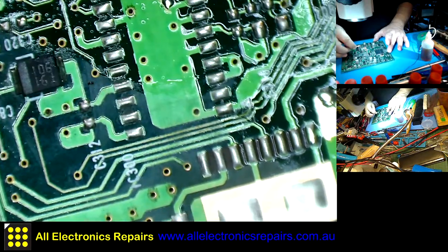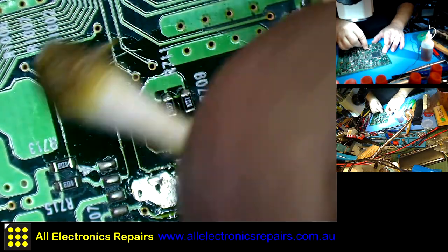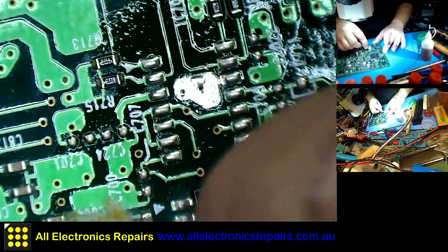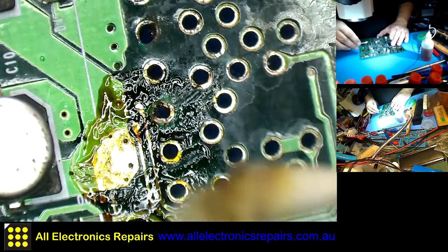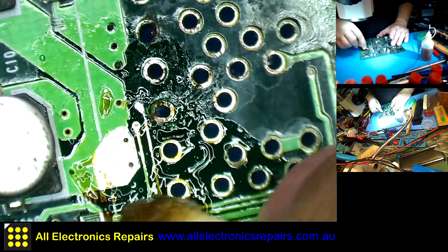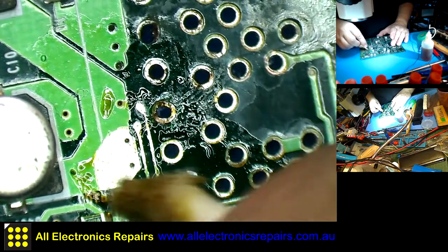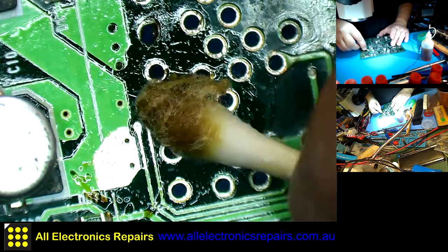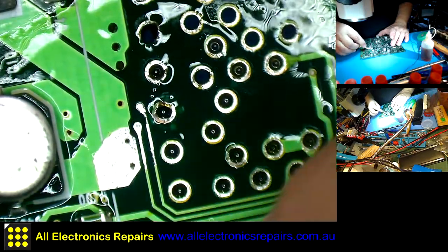And if it keeps on being removed, let's say if rust flakes occasionally from the metal, exposing bare metal, it will keep corroding. So when you leave the flux on a metal, it will keep on removing or dissolving any oxide which forms, and therefore it will promote even corrosion unless it covers the surface entirely, separating it from air or oxygen in particular and moisture or water.